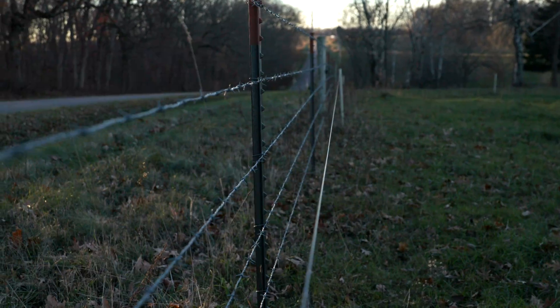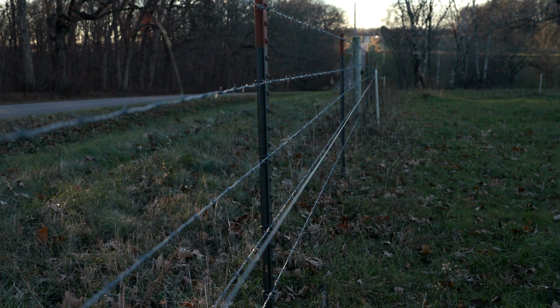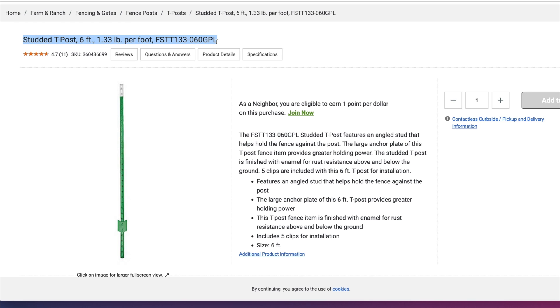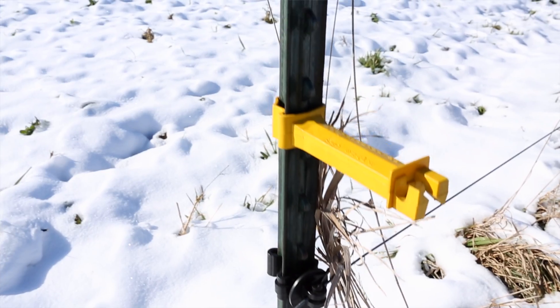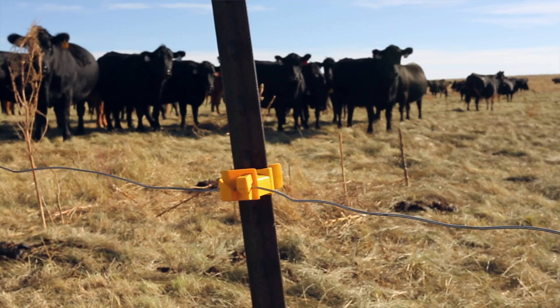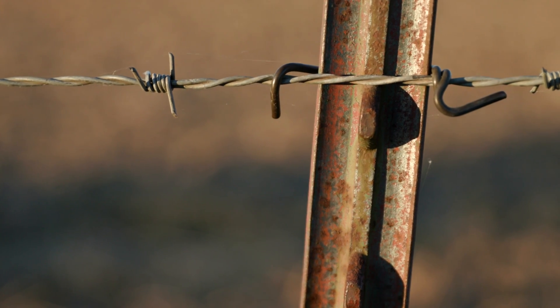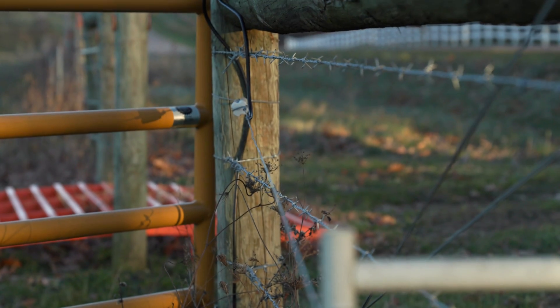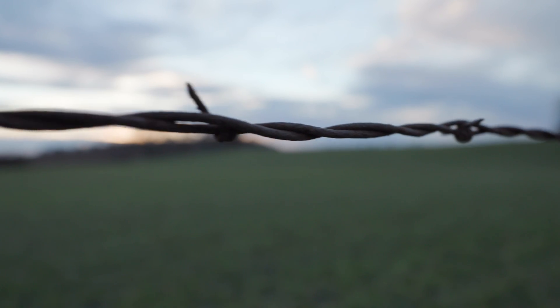With the steel T-post, there is a requirement that it be the 133s — a certain pounds per linear foot of post. With steel T-posts, there are certain insulators that must be attached if you're using them for electric fence, which can potentially pop off and cause the fence to short out. Neither is better than the other. For barbed wire fence, the steel T and wood post are your best bet. Some producers prefer all wood; others use wood posts for bracing and continue with steel T-posts for the rest of the fence.